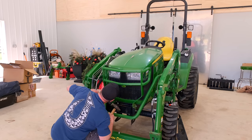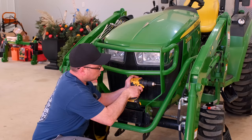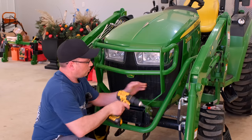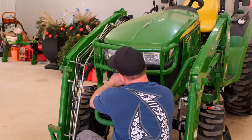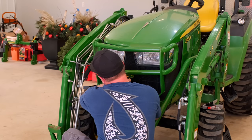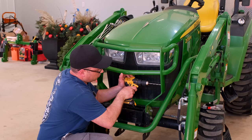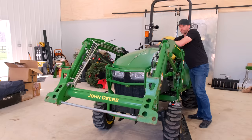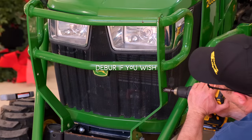Another thing is powder coating. I'm not sure what our competitors do. I haven't seen other competitors advertise this, but we do 5 steps. We do a cleaning, a media blast to get the right profile on the surface to give a good adhesion to the coats. We outgas them to get rid of any oils and contaminants in the steel. And then we do a zinc primer layer, powder coat as well, which acts as a sacrificial anode if you were to get a scratch, followed by the top coat. So there may be competitors doing that, but I haven't seen it advertised. You could certainly cut cost out by taking out a step or two there.